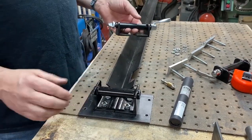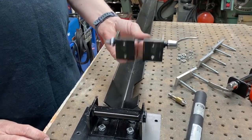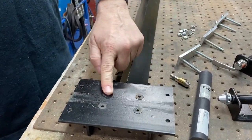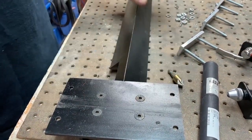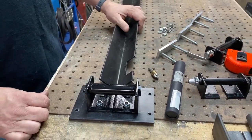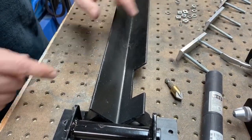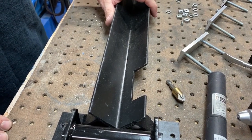As I said, this is modular. This one is set up for the through axle and this one is set up for the quick release. I have bolts on the bottom so you can remove them. I bought allen head bolts and chamfered it so it sits flush, with four mounting bolts, and that holds it pretty good. This little section here is cut out for the disc brake — I made it big enough to accommodate different types of disc brakes and rotor sizes.